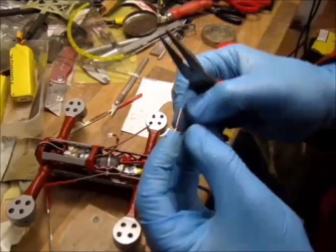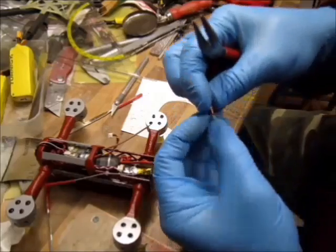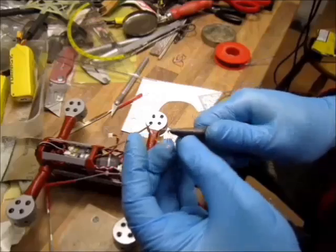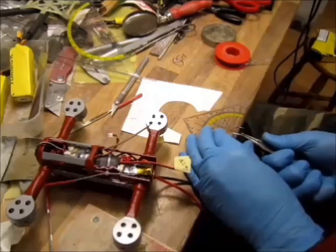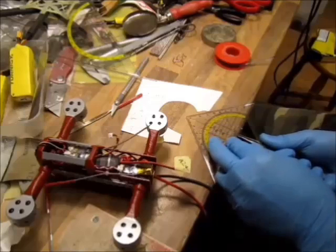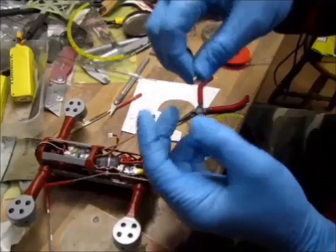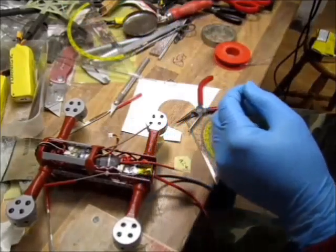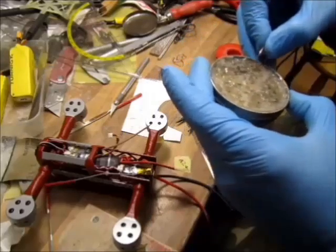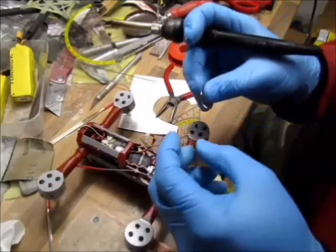I don't have to check. I know that it's 105 degrees. Build loads of these. Now, I'm using right-hand polarization, so I am turning this one 45 degrees towards the right. Eyeballing, I trust my eyes. So, there we go, we have a leaf. Now, before I start soldering, I have to coat a bit of solder on the thingies. Now that I have these coated, now there's an interesting part.